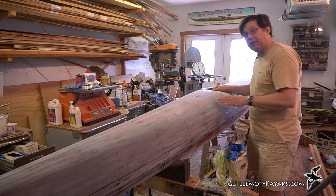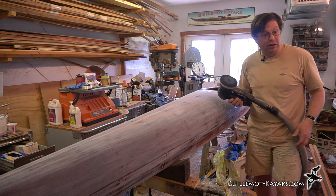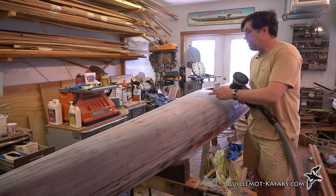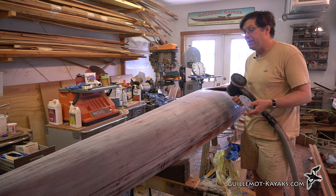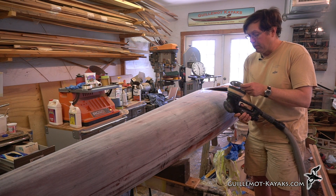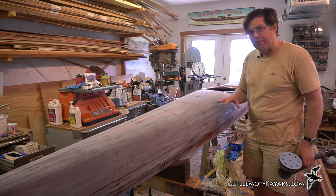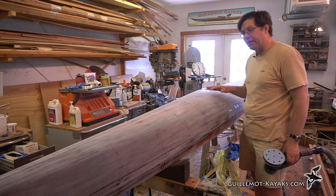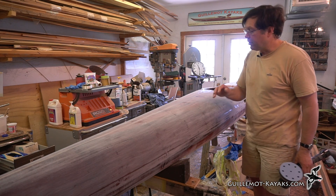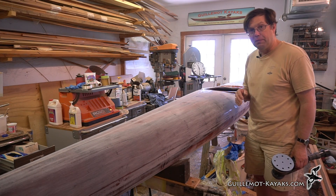I will stop with the longboard. Now I'll go over the whole thing with the random orbital and a bit of a softer pad — 60-grit on this as well. That will probably make those shiny spots disappear, but it won't actually get rid of those low spots, since the random orbital conforms to the shape too much. It'll start to blend things together a little bit more, but it won't actually be getting rid of the low spots — it'll be uniformly abrading the whole surface. After I do the next fill coat and some more sanding, those will all be leveled out.